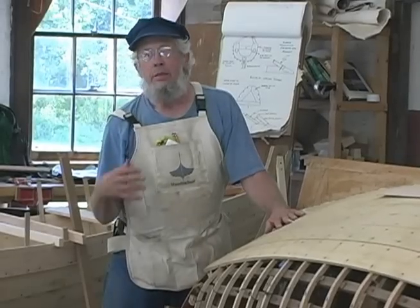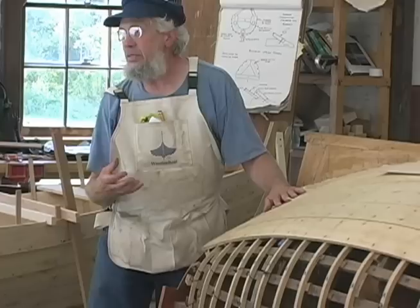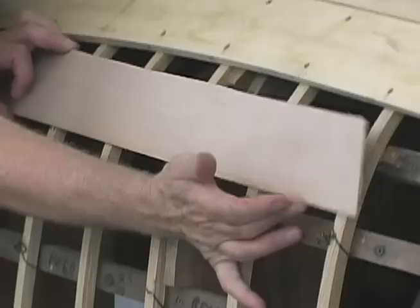The plank that you're going to be making is not fluffy. It's going to be quite stiff, like a half an inch thickness in some places. There's a tendency that if you can edge set something, it does get that. See how it goes on? That's because of the lamination part of it. So it's really only one bend in one way, so it just makes it a little bit more forward.